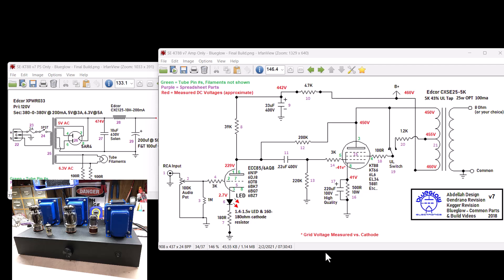If you find something, you've likely found the culprit. My guess is you shorted one of the output tubes by that switch being in a floating open position while switching. Anyway, I used a very simple single-ended amplifier here to demonstrate the troubleshooting approach, but this same approach applies to just about any tube amplifier — push-pull, more complex designs — whatever. I'd use the same approach if it's blowing fuses. Thanks for watching. If you're the person who sent the question and this doesn't solve the problem, feel free to shoot me another email. Otherwise I'll see you guys again soon.